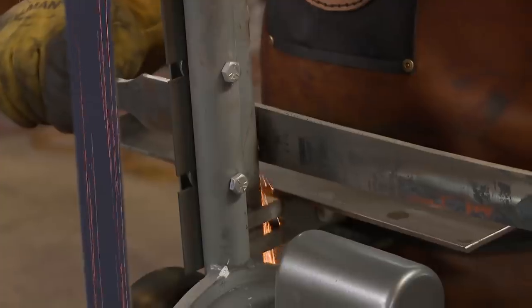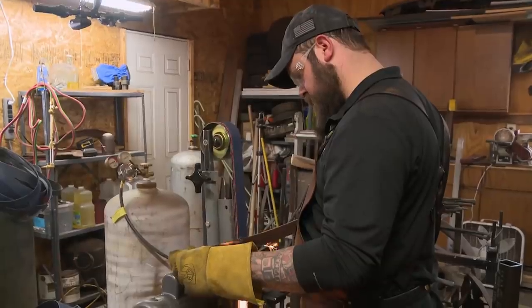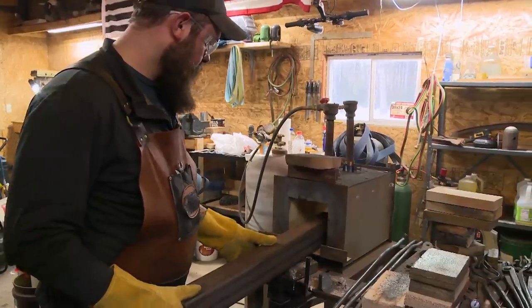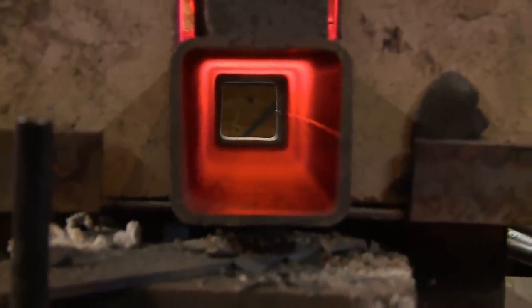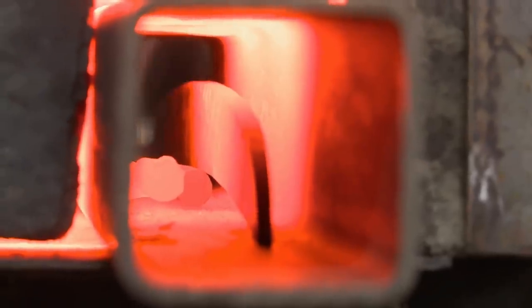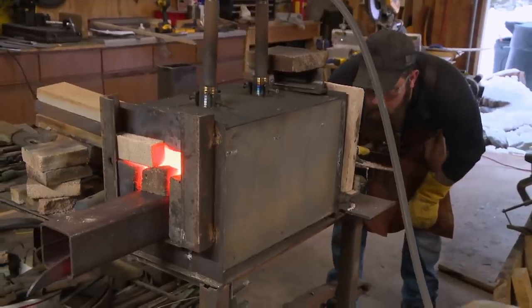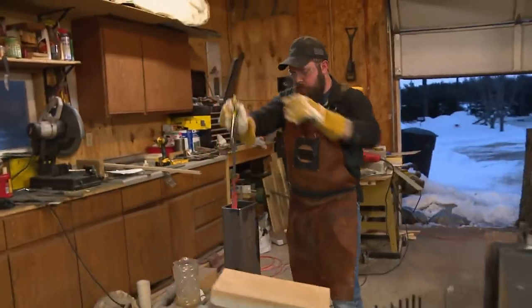Day two, I gotta get this blade quenched today, and I'm gonna make some changes to the way I do it in my forge. I'm gonna try using the tube method. Main goal is to take this tube and just turn it into a nice, long, hot oven. Had a little bit of issues getting even heat last time, so I think with that tube, it should give me a nice, more even, controlled heat.